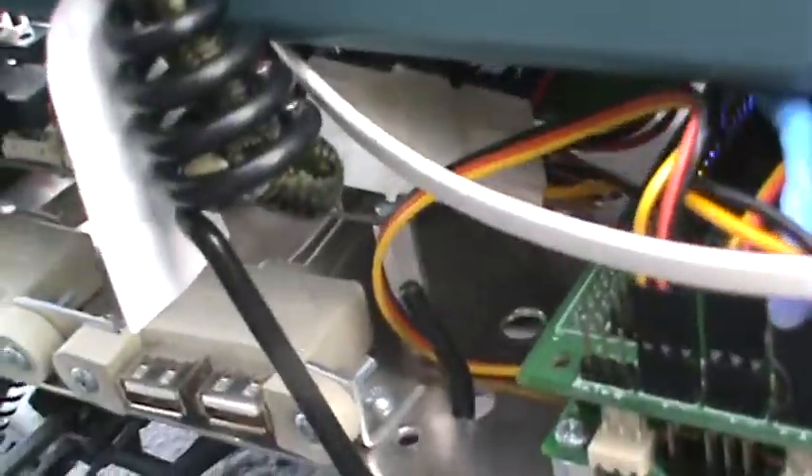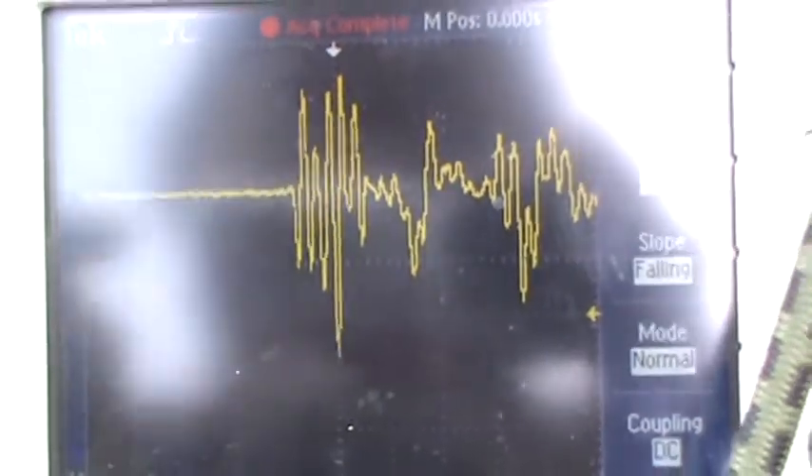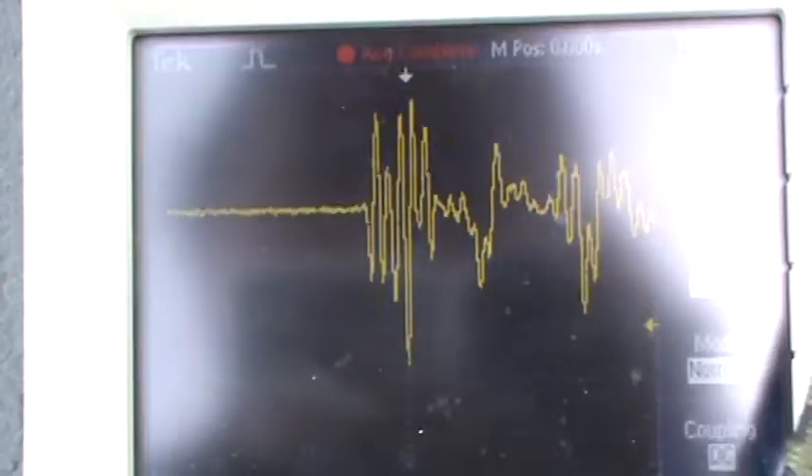So what I'm going to try doing is reset this microcontroller. The microcontroller has been reset. The microcontroller actually appears to be off right now. Actually, if you look at this noise here — this is another huge amount of noise on the 5V power rail. I'll go ahead and save that. Let me see if I can figure out why this microcontroller is not turning on.